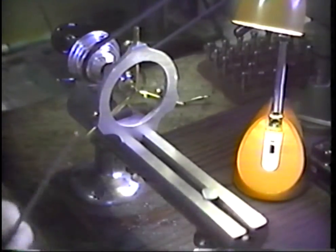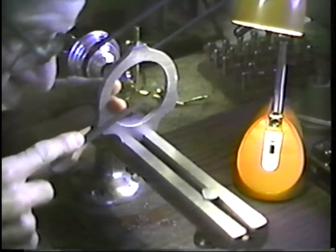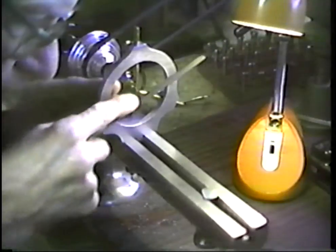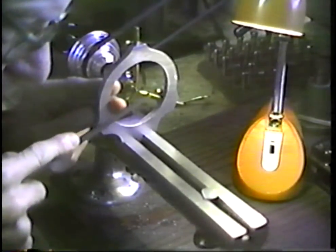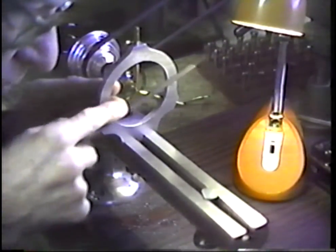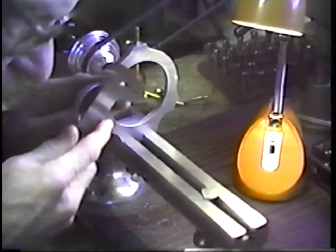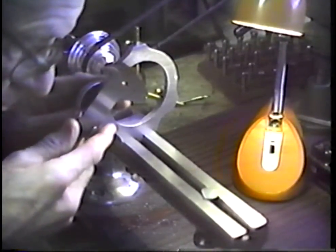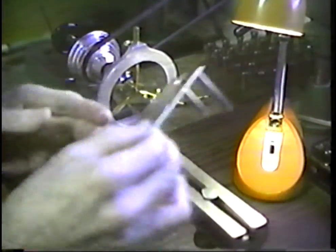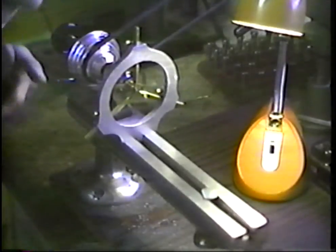It would be easier, and the ultimate job would be equally good if we would simply go into the pivot hole in that plate with a broach and touch it ever so slightly, opening that hole to fit this pivot. However, the thing I want to do is to demonstrate the job can be worked to a dimension rather than altering another piece to fit the one that we have made. Just about there.